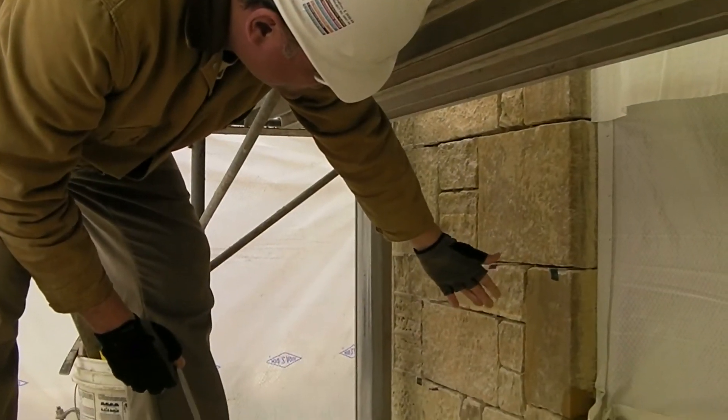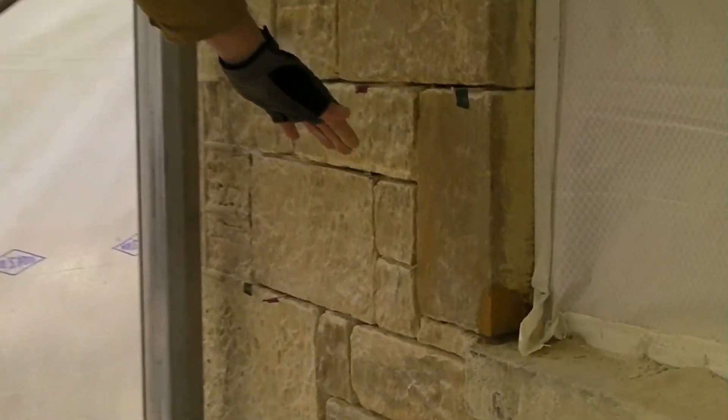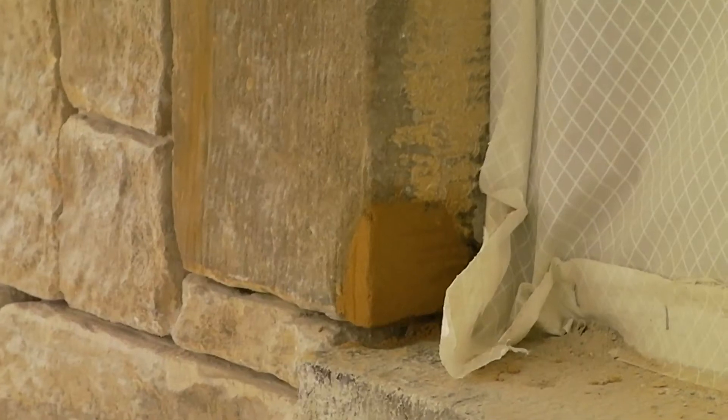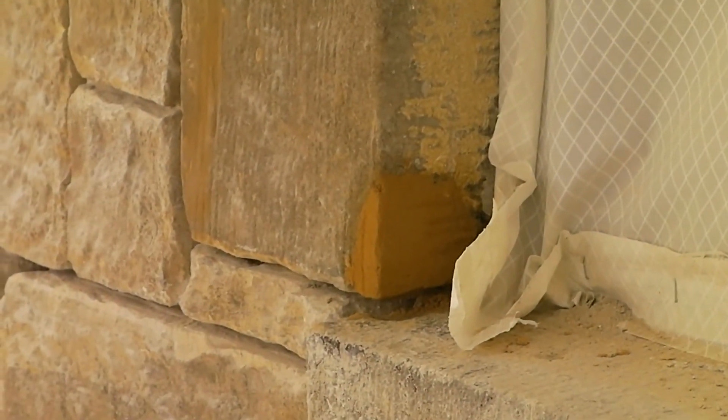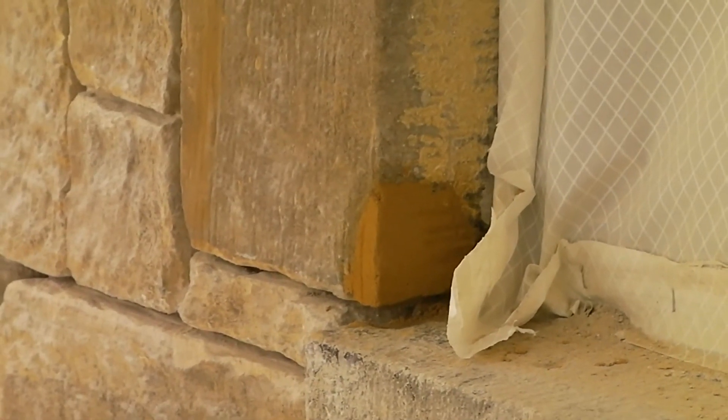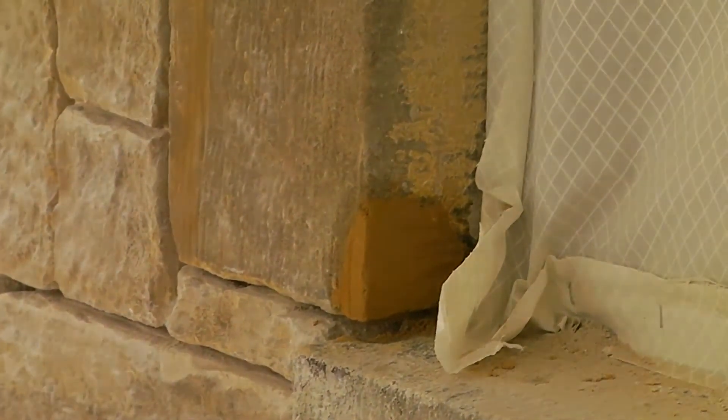The patch is now finished, it's curing out, it's getting lighter, and the actual comb finish has been placed on the side of it. You can see on the side and the bottom is cut for the mortar joint to be received at a later date. So that's ready to go. Let that set.